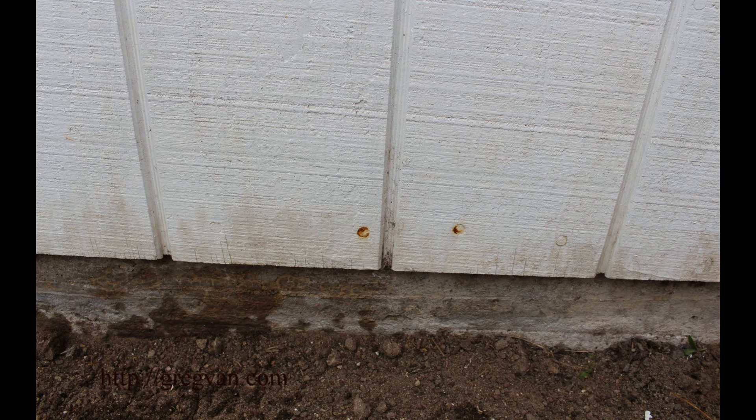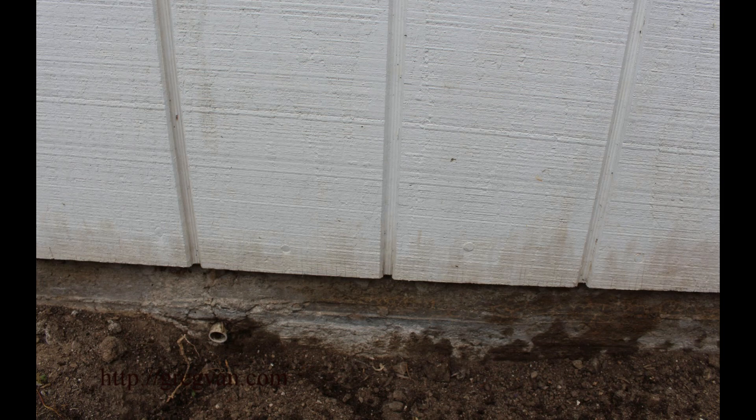Galvanized nails, zinc-coated nails, nails that have a coating or protective layer over them — if you drive them in with a nail gun you can actually chip the coating off. I've seen that plenty of times. These were hand driven, but this doesn't mean my hammer didn't chip the coating off the top. I'm guessing that most of these were the only two nails that were really rusted.